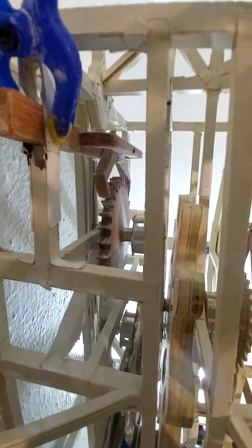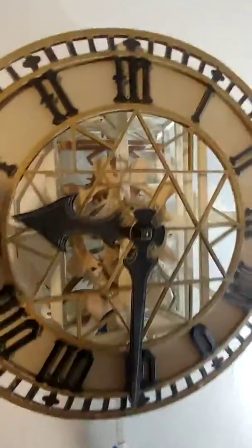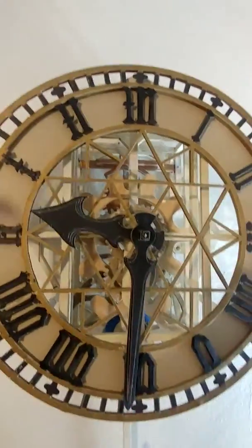So I'm going to use this exact escapement in the Petros wooden clock that I'm designing. Except, you see how that escape wheel there is about 2.5 inches in diameter? That same wheel has been sized up. For the new clock, it's going to be 18 inches in diameter. So the 2.5 inches, it's going to be 18 inches. That's going to be a big flipping wheel.